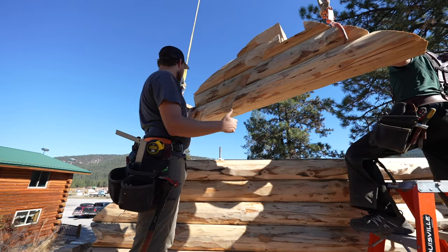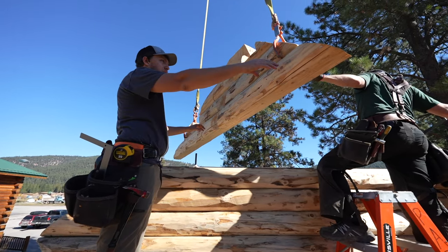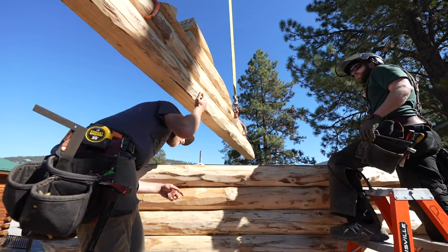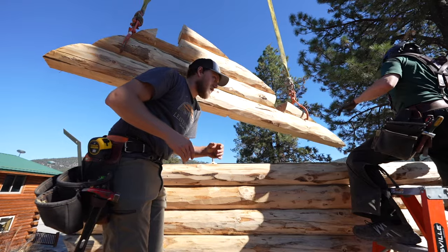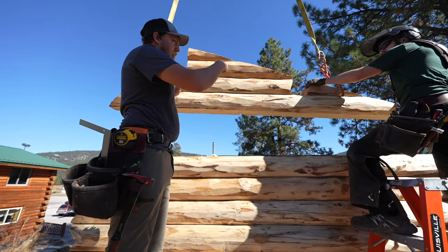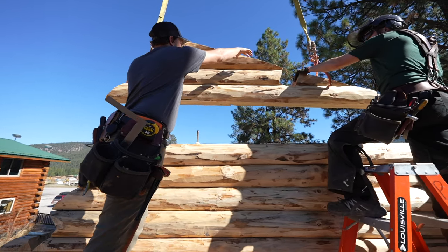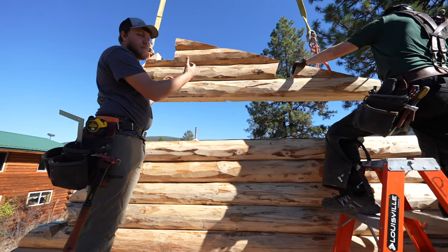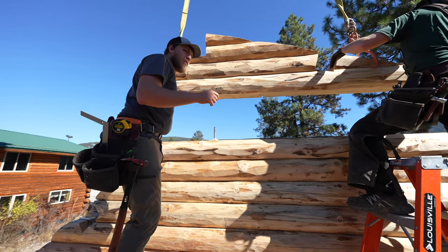This one's pretty obvious. We've got our steep side here, we'll meet up with our steep side on this side. But sometimes if it's the same pitch, then you need to make sure that your marking on top of the gable is oriented so that you're reading it from the inside of the house. All right, we're gonna go down really slow here.